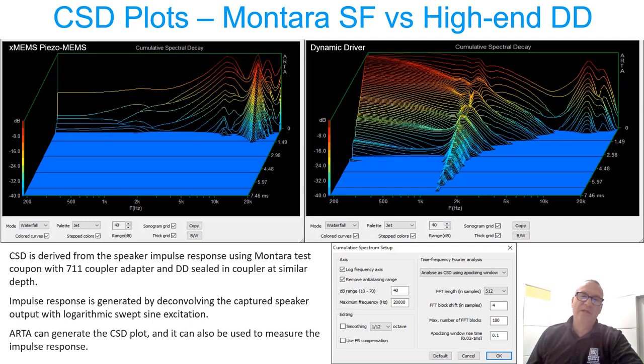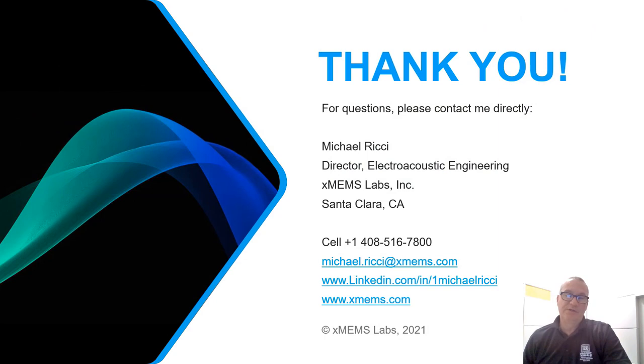Spectral accuracy means that if an instrument is hit and decays, you probably want a speaker that doesn't make that decay last longer or shorter, but is natural to the input stimulus and accurate. These transducers behave very well to incoming voltage — they move quickly, they're very fast, and they stop fast, which means very accurate sound reproduction. I enjoy working with these new microspeakers. They've provided quite a bit of entertainment and some challenges, and they never cease to amaze me. We have one running for 13-plus billion cycles nonstop at 30 volts peak-to-peak, getting somewhere around three and a half years of continuous use without failure.